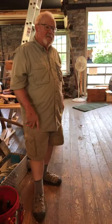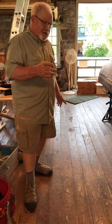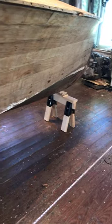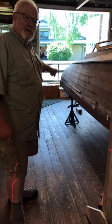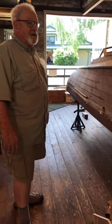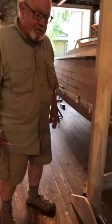As it so happens, this floor is as level as anything I've worked on, because it's only a 1/16 of an inch difference between the point zero and the overall length at 24 feet 7 3/4 inches. So the old stone building's doing okay in that regard. The old stone building has a good floor. Good.